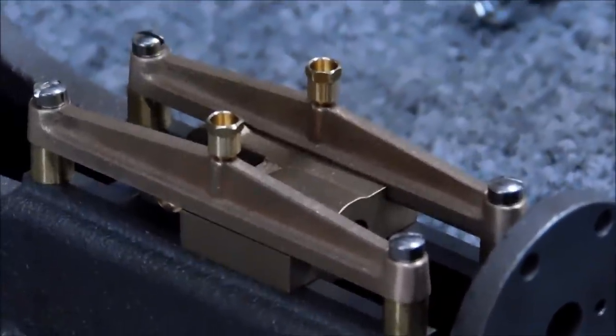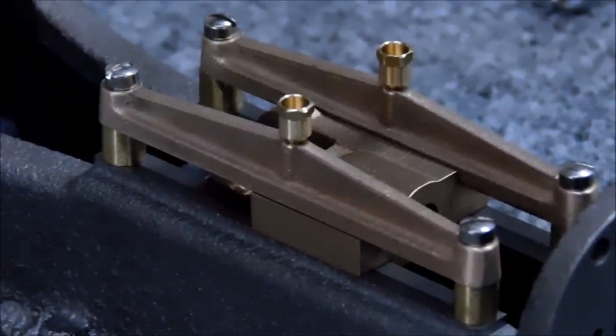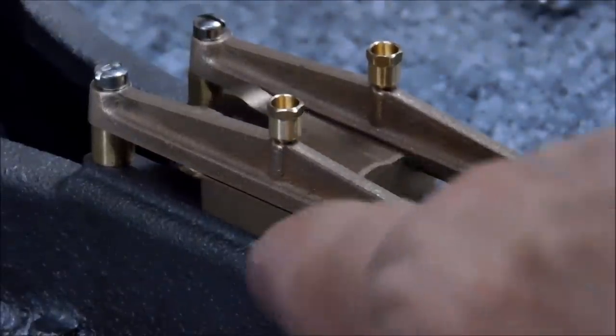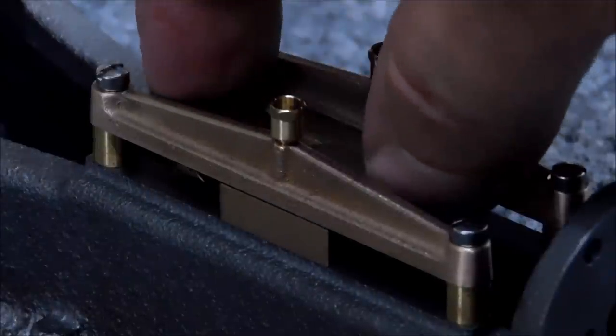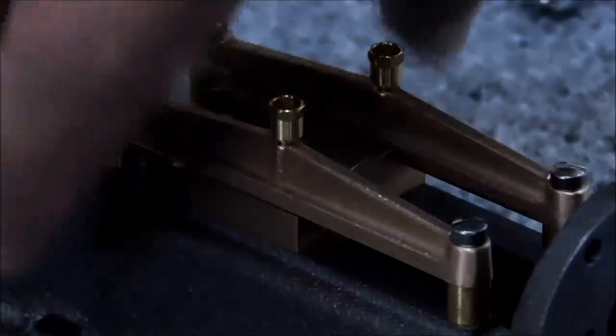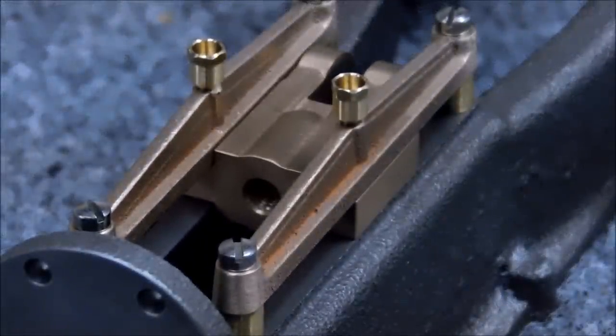Everybody that's going to leave a comment about using hex head bolts or nuts and studs — you are absolutely right. These screws really undermine the authenticity of the way this thing looks. But you can see what the little holes are for in the arms: the cup fills up with oil, sits there as the crosshead slide rolls back and forth, drips down onto the casting underneath it. And as it passes under, it drips down on the top as well, so it keeps it fairly well lubricated. I am thrilled — that is just beautiful.